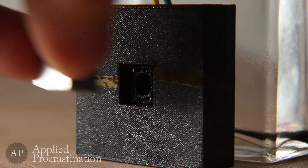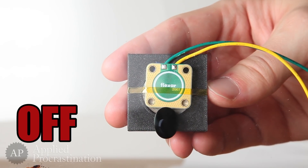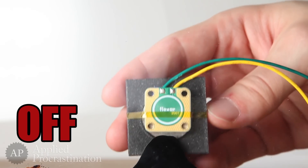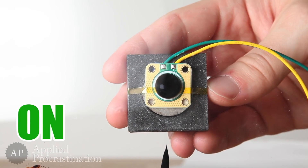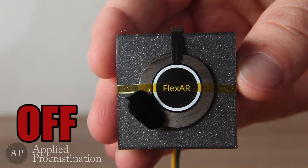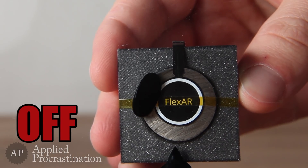Kind of does make you wonder how much better that would work with a background magnet though. That is pretty cool! Although the ferrofluid is drooping quite a bit because we weren't able to center the electromagnet on the iron cylinder due to the cables being in our way. The iron cylinder could also have been a tad smaller, as the permanent magnet's field lines are being guided towards the circumference of the cylinder — so it would have been better if those edges could have been behind the PCB.